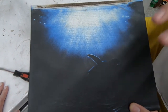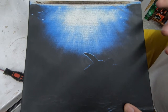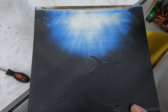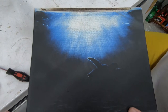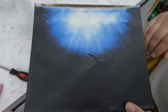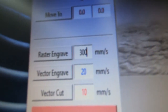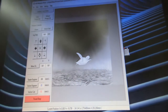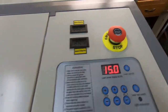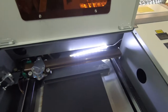Essentially what we're running into is we don't have enough layers to use a high enough percentage to get any gradients in the burn. So what we're going to do is prep another one — three coats of white, three coats of blue, and then a black coat over the top. Hopefully we can run it at maybe 15% and not burn clear through to the canvas for a better overall dynamic picture. Our settings are 300 millimeters per second for the raster, the picture is flipped backwards, and 15% on the power.